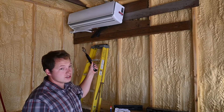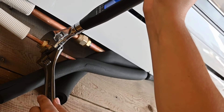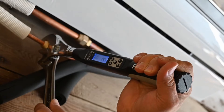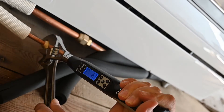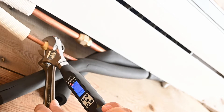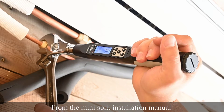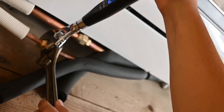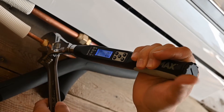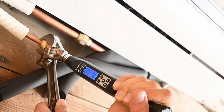So we're ready to torque a couple of fittings right up there. I already have my flare nut finger tight, so as we tighten this the torque wrench will tell us when we have reached the correct torque setting. Now we've reached the proper torque, but according to the instructions they want us to actually back it off, and then reseat that flare fitting one time — which is going to help that face seal up properly. So now we'll re-torque it again to the proper setting. Perfect.